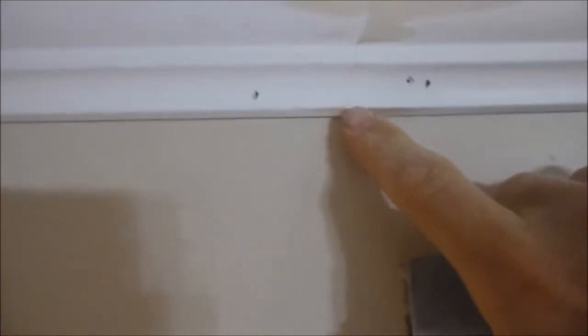I've got a little bit of a lip on the bottom. I'm not going to be repainting anytime soon, so if you use your block and have your sandpaper where the foam pad is at the top, what you can do is turn it so the foam pad is toward the wall. That'll keep you from scratching your paint — see, it's just foam. I still have a corner here to sand the top edge, and that way you won't see the seam line where it butts up. It was off by about an eighth of an inch. Now it's nice and sanded smooth, and with a little fill right here at the bottom you won't even see the small gap.